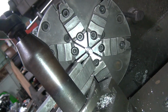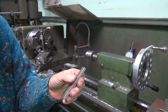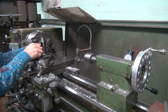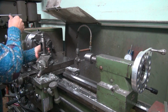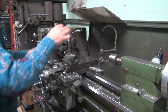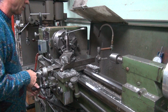So, see, this needs to be on the center point of this, not way down there. So I'm going to put a shim under here and move it up. That's what those are for over there. So I'm going to use this quarter inch one right here. Should get me about where I want to be. I have some other stuff I could use to do this, but I'm not doing a precision cut here. I'm just roughing it in, so I don't really care about the finish or anything. So I'm just going to go ahead and go for it. What the hell with it. I'm not even super critical about being on center of my angle either. If I'm off a little bit on my angle, I'm not sure either. Still on the low side. I'm going to kick the angle up a little bit. Very limited in my tooling here. Okay, I can go all the way over there right now.